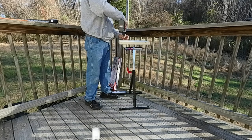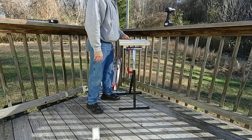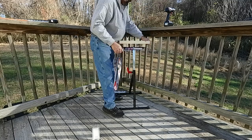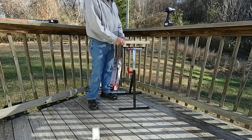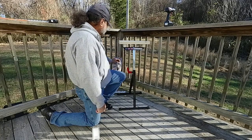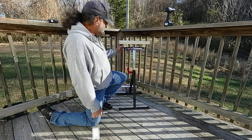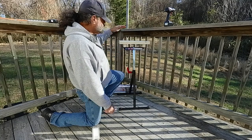And the last screw here. The nice thing is it does swivel a little bit if we need to — on ground that's not necessarily stable — but then once you get it to where you want it to be, just tighten up the bolts a little bit. And there you have it — our $20 shooting stand. Harbor Freight roller stand: take off the roller, cut your pieces — two 16-inch 2x4s, two 6.5-inch half-2x4s — and some screws. The inserts for the 3/8 bolts, 3/8 bolts, and washers. And you're all set.